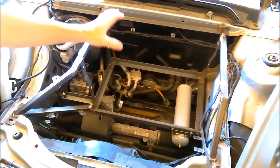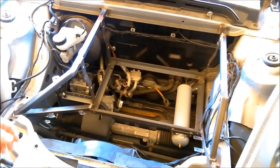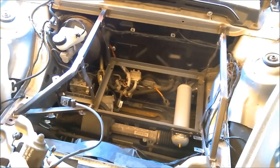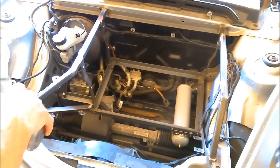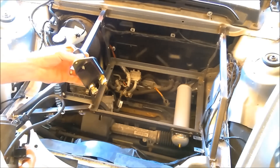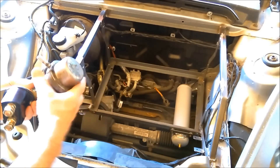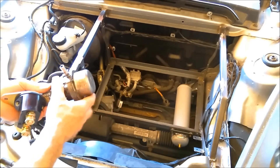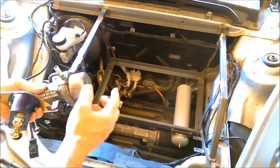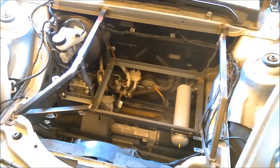I've taken out the battery and tried positioning a few of the other things. The other things I need to include are the fuse - I think the fuse is better actually mounted to the front of the battery pack, so I'll have a bracket on the battery pack. The other thing is the main shut-off switch. And the other thing I need to get somewhere in the front here - I was going to put it in the back but I think it's probably best in the front - is the vacuum pump, because I obviously don't get any vacuum from the petrol engine now. I've got this pump which is a Mercedes vacuum pump, very apt considering it's a Smart.